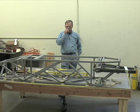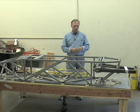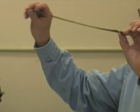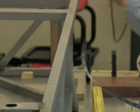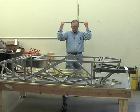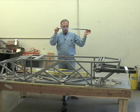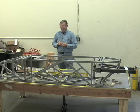Now, if you have uneven surfaces to measure, something round, something oblong, this is a seamstress cloth ruler. They're subject to stretch. However, you can wrap it around things, get a reading, then translate that to a known accurate ruler. That's the way you do that. So if you have to measure something around, like your head or something like that, and you want an accurate reading, you translate whatever the reading is here to an accurate ruler. So that's a good little trick to know.